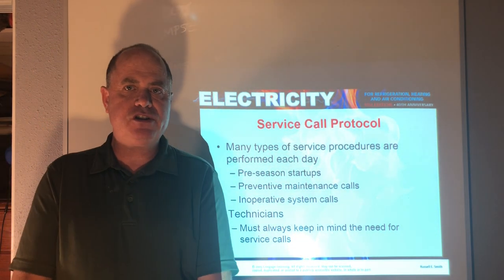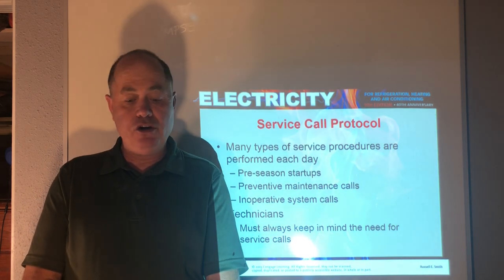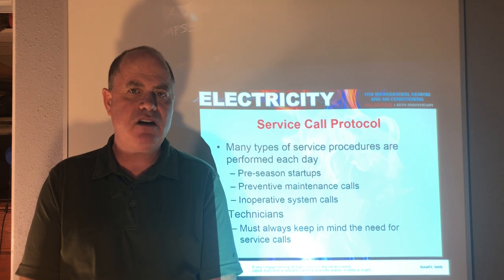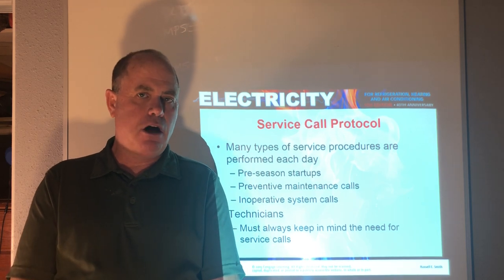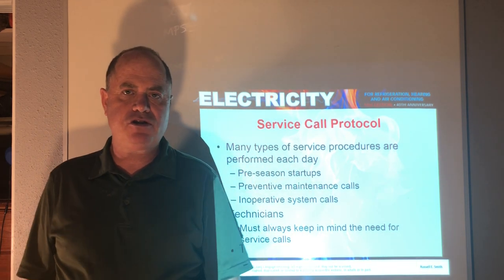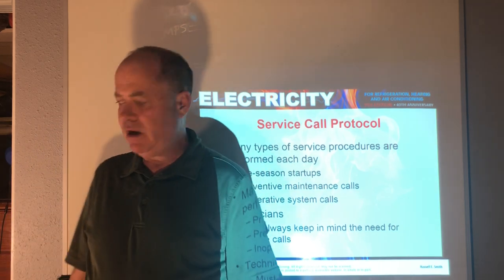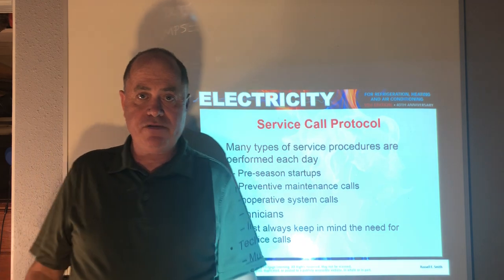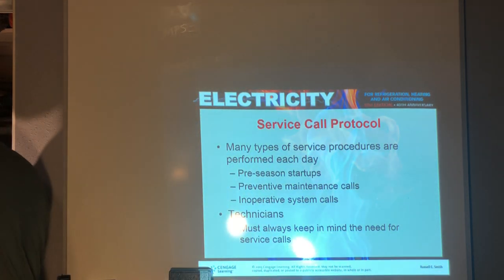Making sure that motors are operating good. You know, it might be a good policy on very large motors, pumps and fans and whatnot, maybe to keep a log where when the ambient temperature is a certain thing, you can take an infrared temperature gun and take the temperature of that. One moment, I think I have one here.